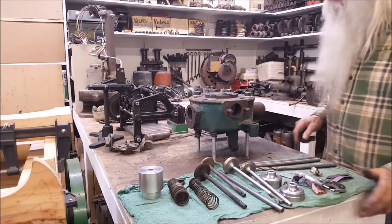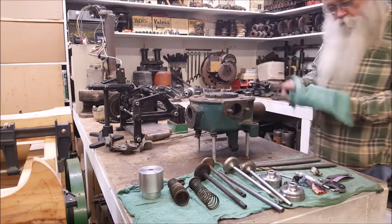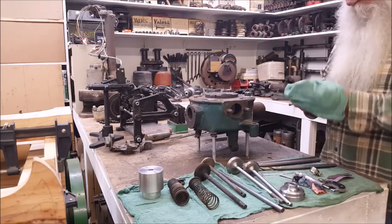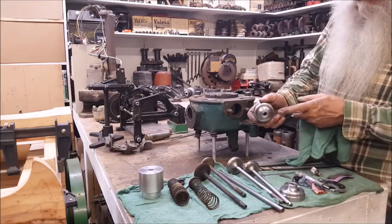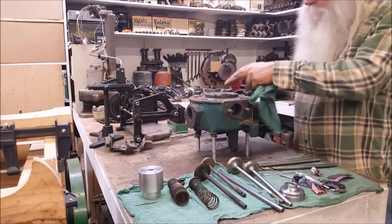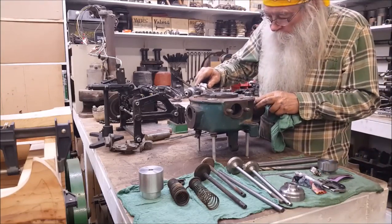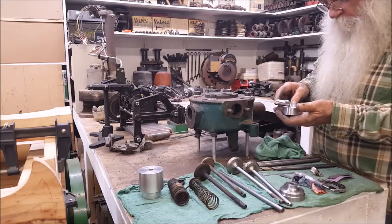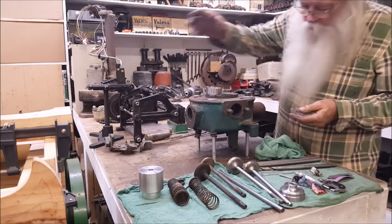The reason for the shoulder is, I'll show you. I made these over on that Grizzly lathe. It's 8620 steel. I think it'd be the perfect valve head. It's contoured there and it's got a 45-degree on it. The whole amount of this is made oversized because I'll have to cut the seat in order to measure across that way to the center, to the seat, so that at that point I'll know what size to turn this valve to fit that. But it'll go right there.